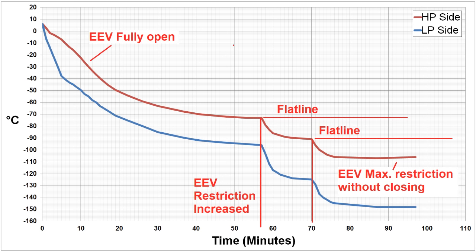However, this temperature range would still allow me to liquefy methane somewhere between 7 to 10 bar, which is only around 90 to 130 psi gauge. When discharged to atmospheric pressure, it should cool to minus 162°C. So let's try to make some liquid methane.